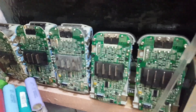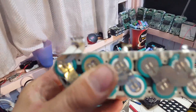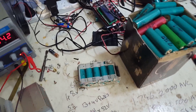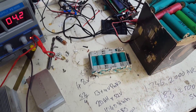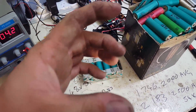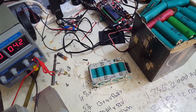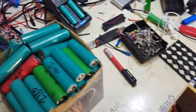It's only a matter of taking the boards off the top of them, pruning the wires, and linking all the terminations together. Securing them into a toolbox was the idea — make an awesome 18-volt power source. And a little USB power board, about this big — four USB ports, multi-voltage input, six-amp charger. So you can run numerous USB devices off it at a time.